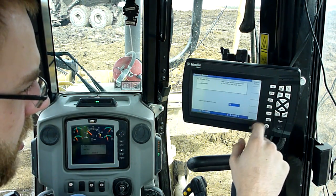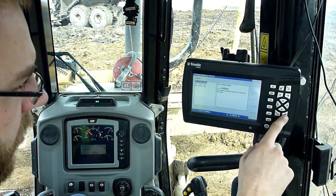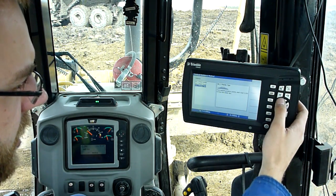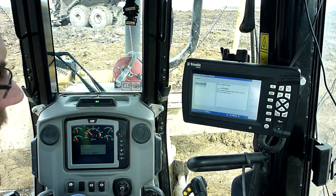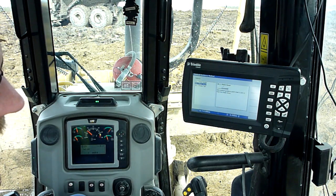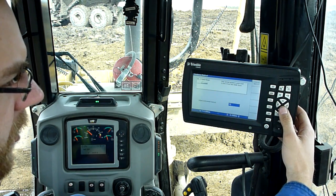Guidance method — talked about that a little bit. If I do one-point center, it's going to try and pick the middle of the blade. If I do two points, it'll use both sides. If I go one-point focus, it'll use just that one side. That's what I'm using right now because the slopes are so narrow that my blade is actually wider than them. If I tried to use the two points, it wouldn't know if I'm on the road top or in the ditch. So we're just going to use a single point.